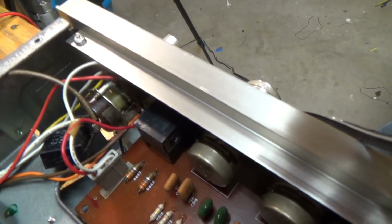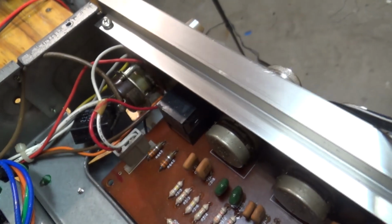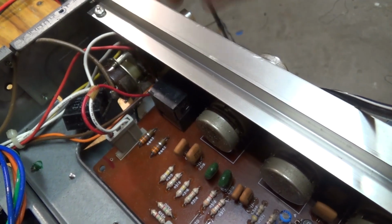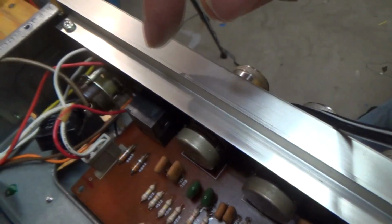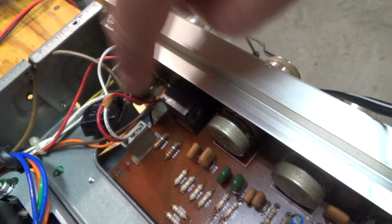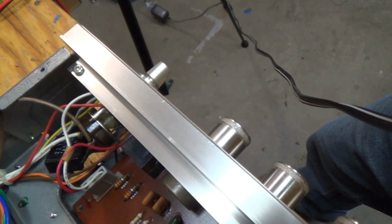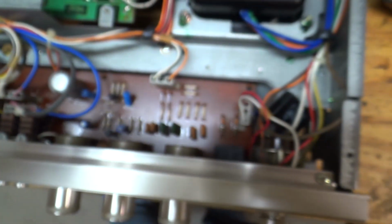One thing I'm happy to see is over here on the switch. The model of Toshiba that came out after this one had a different switch, and they would always get kind of corroded. They were pretty bad on all three that I've owned. This one has the power switch and the speaker switch together on the same shaft. This is looking pretty nice to work on. All those capacitors are easily accessible from either the bottom or the top. This is kind of remarkable.